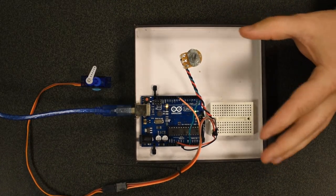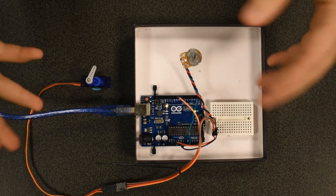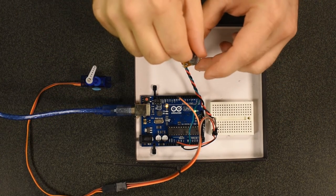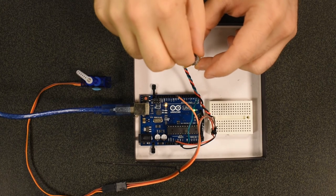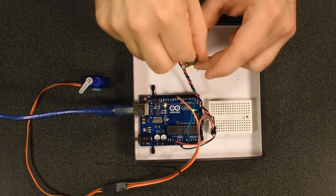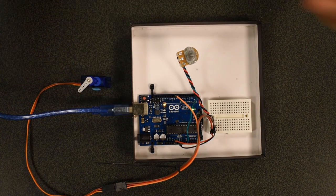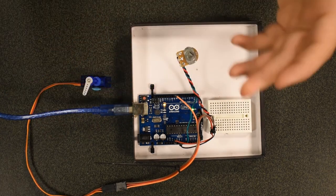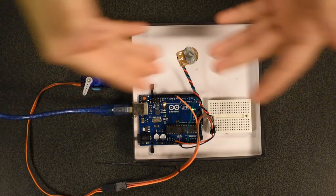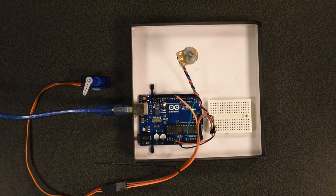the software on here is called the Arduino knob demo for servos. This potentiometer is set to control the servo's angle. So by adjusting this, the software translates that into commands to the servo to set it to whatever angle you want. Now, servos, of course, need not be driven by a potentiometer, but by any software choices you make in the Arduino.